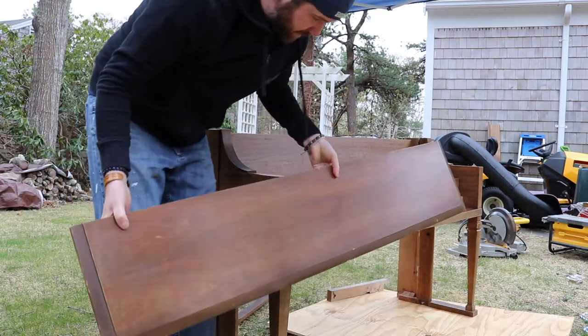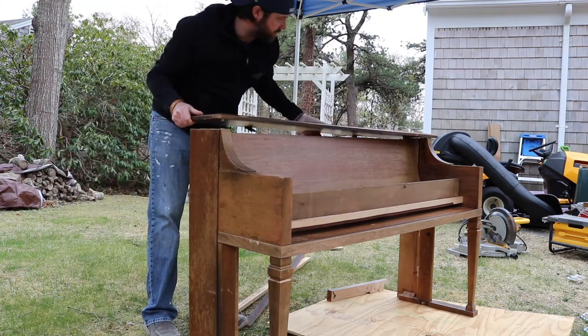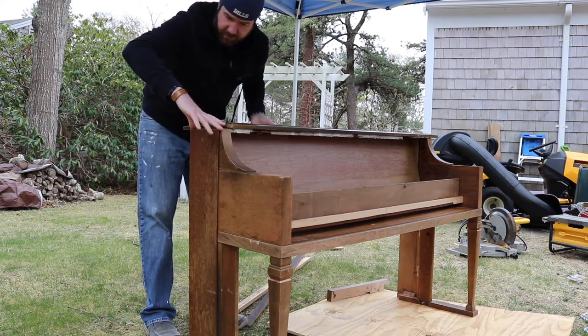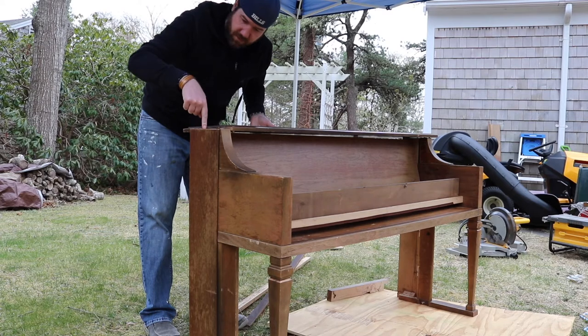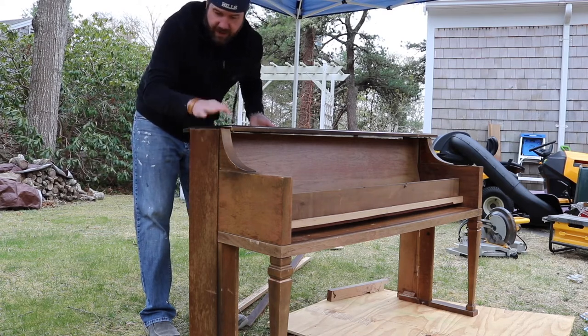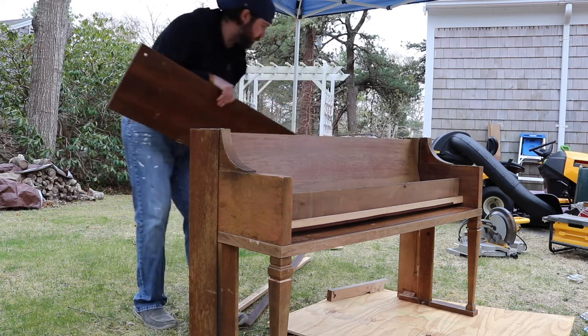So I'm gonna basically cut the back off of this to make it only this long, and then just trim the edge, and then I'll do a countersink hole, then put the screw in through the top of the new wood so it doesn't split out, and that'll cap the ends, and then this piece will all be waste wood in the middle, or waste material.